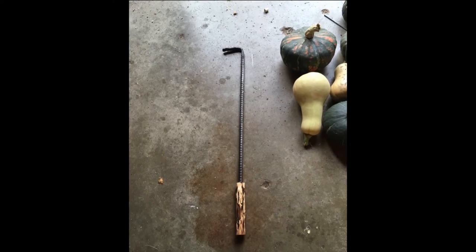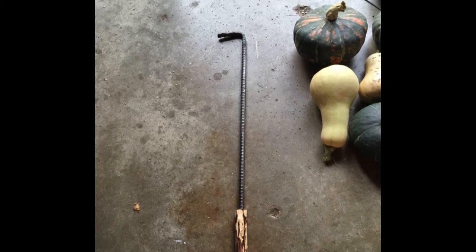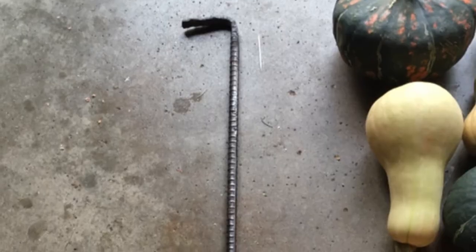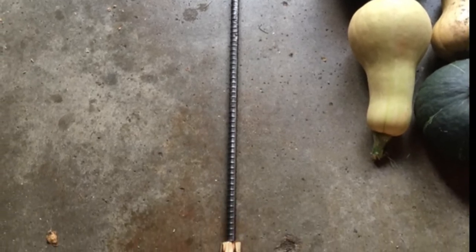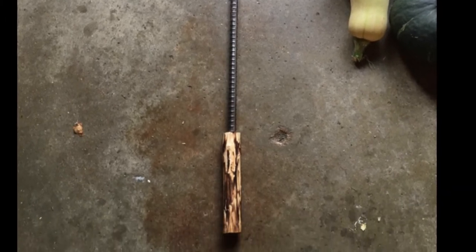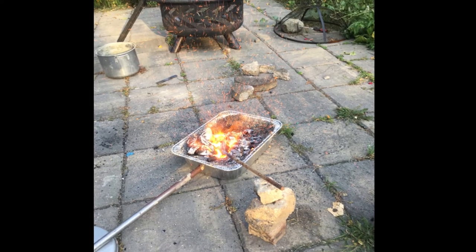This comes to us from Justin, who's 13 years old. He lives in North Dakota, and when he started forging just a few months ago, he didn't have an anvil yet. So when he forged this coal spreader, he actually used a flat rock to do the forging. He used half-inch rebar and a fresh-cut pine branch for the handle. Because of the ridges on the rebar, this is actually a pressure-fit handle. And then to finish it off, he scorched the wood with a propane torch to give it a nice finish and also to add strength. So he made this to use with his charcoal forge for spreading and moving coals around.